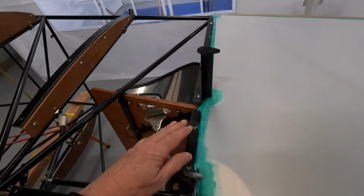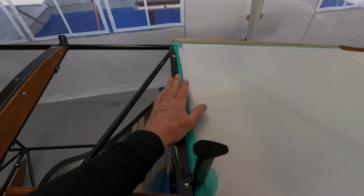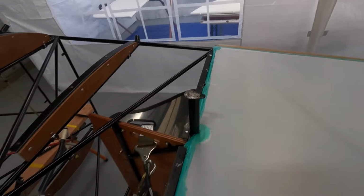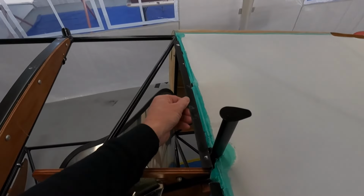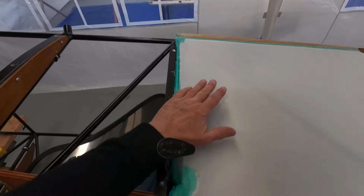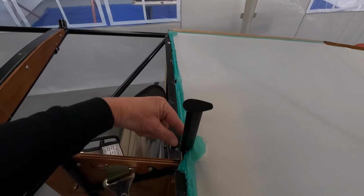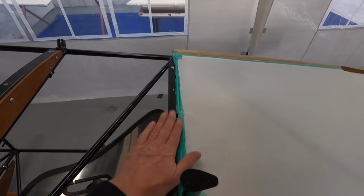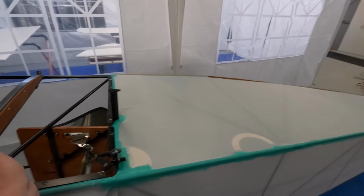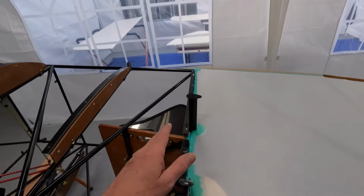I think what I'm going to do at the front here, in my mind, I haven't got enough glue adhesion, especially on a leading edge to the airflow. This is where the fabric starts and stops. I've been through a lot of doing these tapes, doing these brackets at the front here. So what I'm going to do is run a 2-inch tape up onto this, but I won't shrink it. Once this is pre-shrunk, as long as it hangs on and doesn't pull away, then I'll come in with my 2-inch tape and finish that edge off nicely, and it'll glue to this L angle as well. Just give it a bit more bite. If that popped off in flight, you'd just rip the side of the aircraft off, which would ruin your day. So that's what we'll do there, I think.